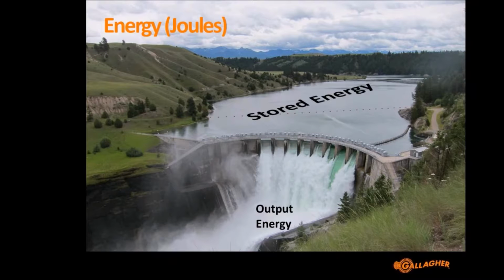So stored energy represents how much the Energizer's got in capacity, and the output is what the Energizer can output onto a fence that is matched perfectly to it. So it's the peak output. Of course, you need a lot of things to get that output right, such as you need the right lead out, you need a fence of the right load and all these things. So it's really to give you a ballpark guesstimate.